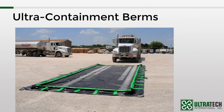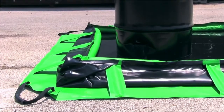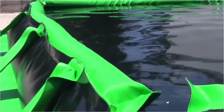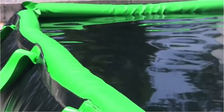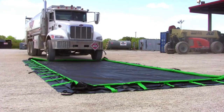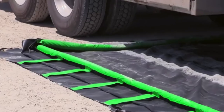Next up is the rapid rise model. This model is unique from all the other models in that the sidewalls will actually lay flat during day-to-day operations. In the event of a spill, a foam ring encased in the top perimeter of the berm's sidewalls will float on top of the spilled liquid, causing the sidewalls to rise with the level of the liquid being collected. These sidewall struts provide additional support when a spill reaches higher levels. Because of the way the sidewalls function on this model, it is considered a true drive-in and drive-out berm, and it has the added benefit of the lowest profile of any of our berms, which will minimize tripping hazards.